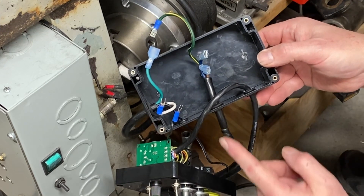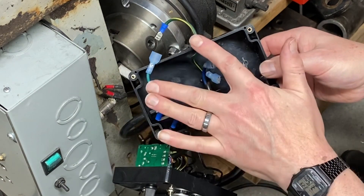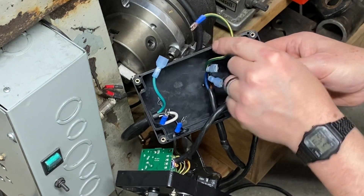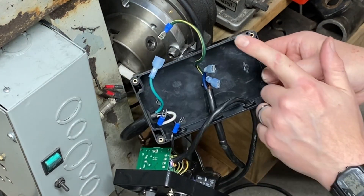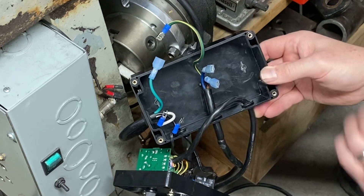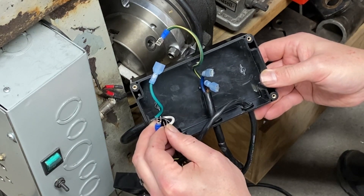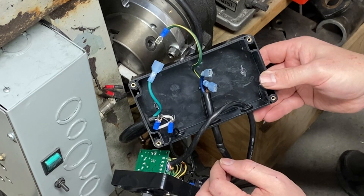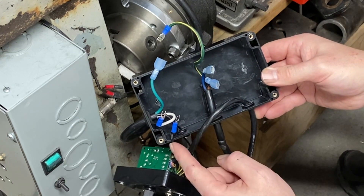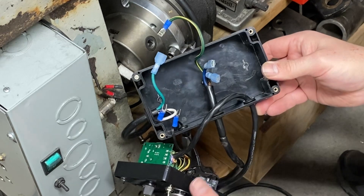So this is how I ended up wiring all this up. This is the master power coming in from the wall, going to my switch. I always preach about using green wires and making sure everything's grounded. If this were a metal box, I would have tied the ground wire into the box so the box itself was grounded. Then this is the power out that goes to the SCR voltage controller power supply, and I also have a thin wire coming from my potentiometers going to the SCR for speed control.